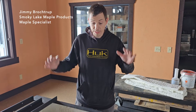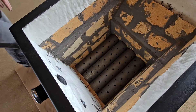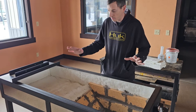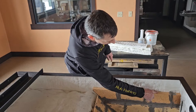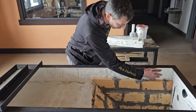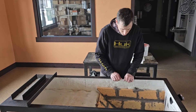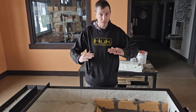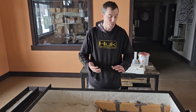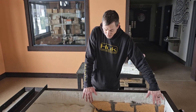We're getting to the last phase of setting up this Corsair arch with all the insulation and bricks. We got our dome grate set, we have our bricks laid in, and we have a couple final pieces of insulation to put in. These are the insulating strips that go along between the top of the brick and the top rail of the arch. It's really important that we protect this rail from heat — if that gets hit with heat, it's going to want to expand and move, and that's what metal does. So we're going to lay another strip of insulation approximately 30 inches along the top of the brick and tuck that in.